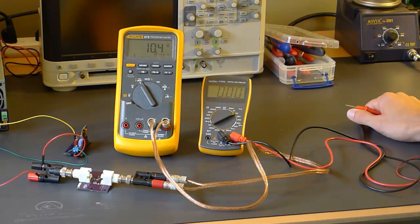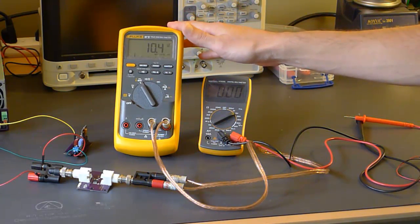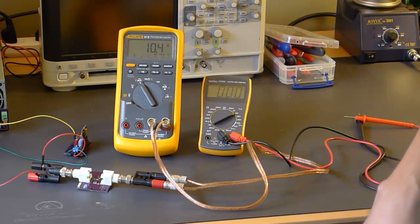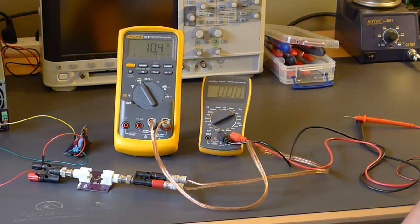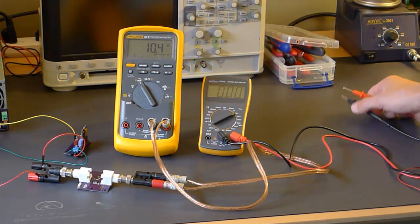The device isn't doing anything right now — this is the solid-state relay I designed. It's currently not sinking any current, so this is just how much current the IC draws while it's idle — a small number. And of course 10.4 milliamps is the number when the motorcycle is turned on. We already saw the number when the motorcycle is turned off — about 15 nanoamps — which means it will not injure the battery at all.